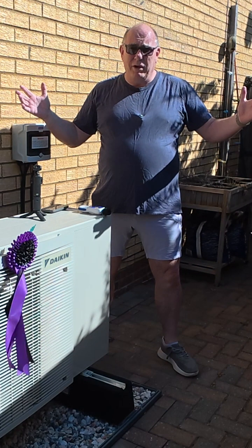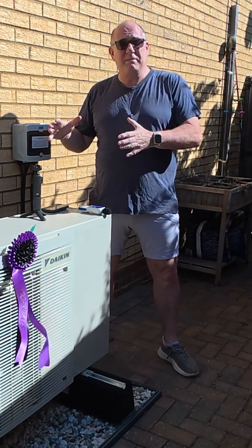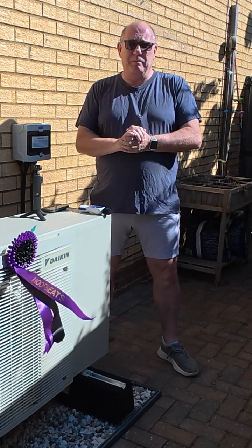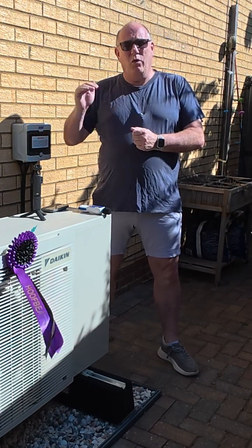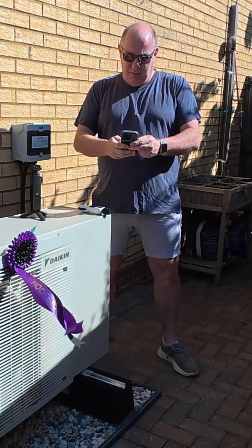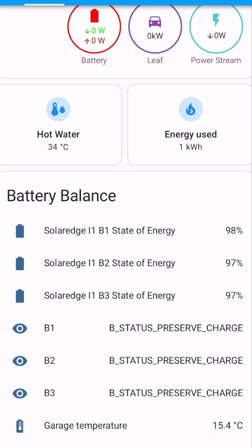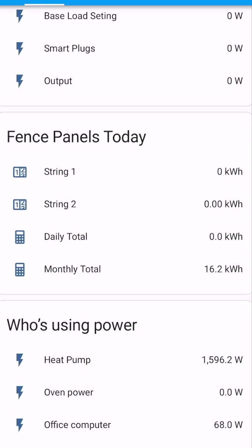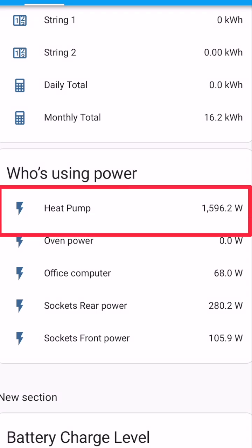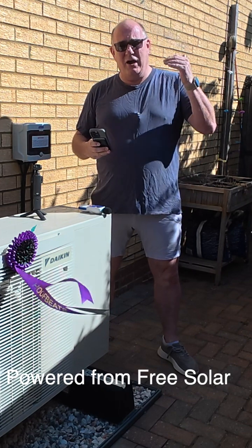It's a beautiful morning here in Cambridge and, as you can see by the visual indication, the heat pump is running at full tilt. The reason for that is I deliberately emptied our water tank completely this morning. If you take a look in my Home Assistant, the water temperature in the tank is 34 degrees — it's starting to fill up — and the heat pump is currently pulling 1596.2 watts because it's trying to reheat that entire tank of water.